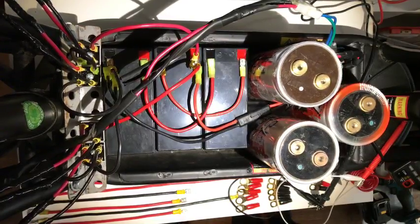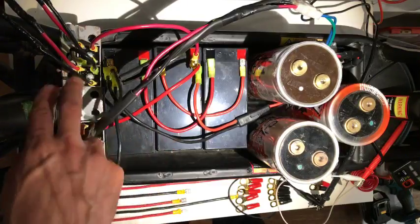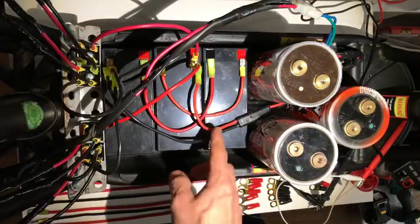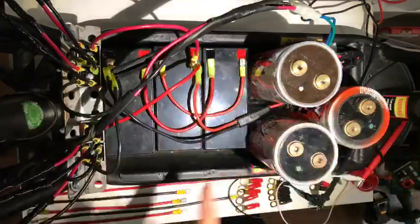What's the test we did where we spun the alternators with a drill to charge up the capacitor? The test I did had the batteries connected to the alternators through the bridge rectifiers, and then we had the motor connected to the controller. So we had it basically without the capacitors.